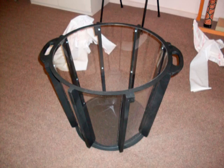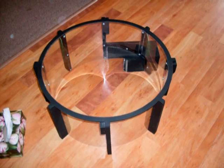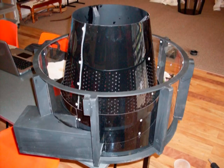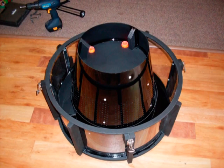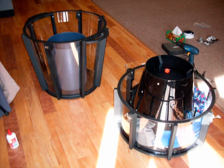Getting all the pieces together, taking the protective sheets off the polycarbonate — you can see the sheet screwed into the bin. The inner bin is placed on the inside. All these parts, other than being screwed in place, were also glued for strength and for sealing any spots where air might leak out around the edges — pretty important because you don't want dust bleeding out of the cyclone inner or outer area. All the edges were glued and sealed to make sure there wouldn't be any leakage.